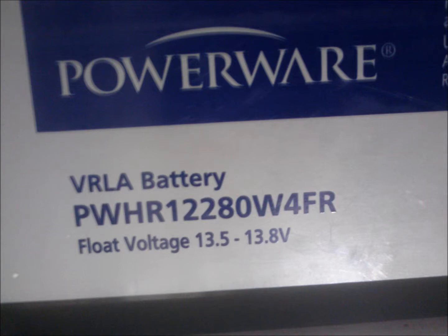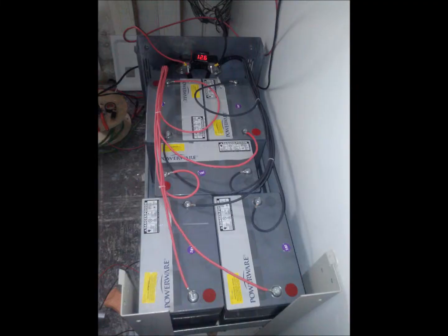This bank is made up of 10 75Ah batteries running in parallel. When using a parallel configuration, it's particularly important to use equal length leads from each and every battery to a common bus bar — that's 10 positive leads to one bus and 10 negative leads to another bus.